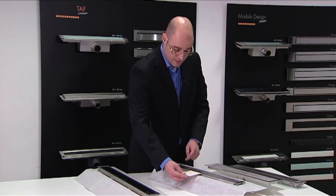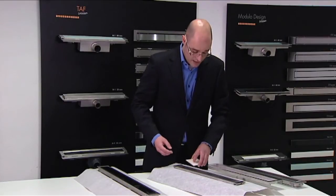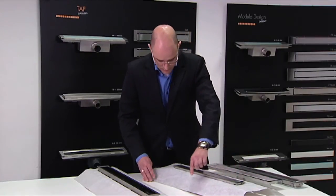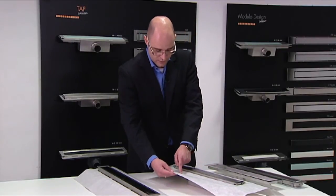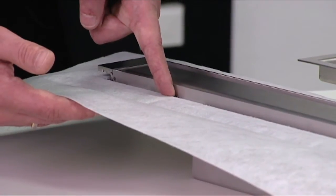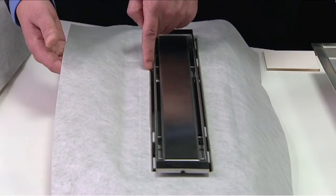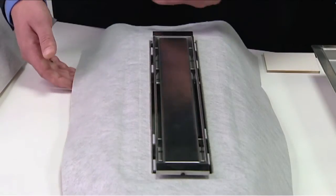An extra benefit of this tile adjustable frame is a so-called secondary drainage. If there would be a leak around the shower drain, the water will flow down to the membrane, and because of the sloping of the bathroom, the water will still run inside the drain body instead of being blocked by a vertical flange over here.